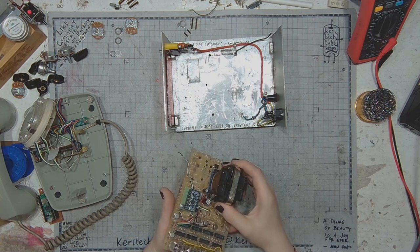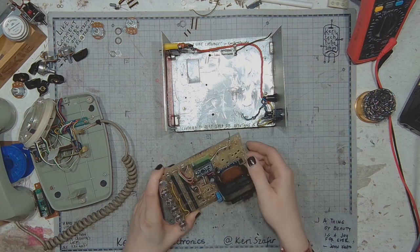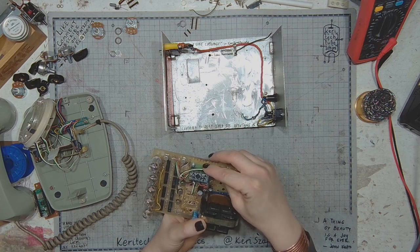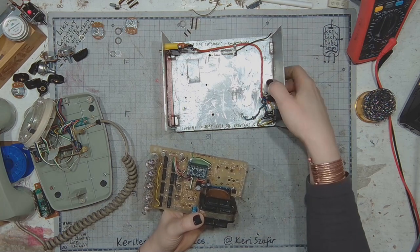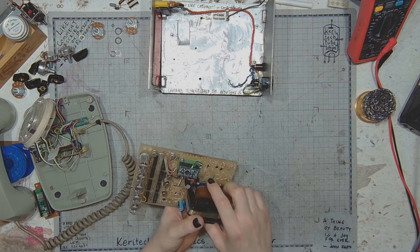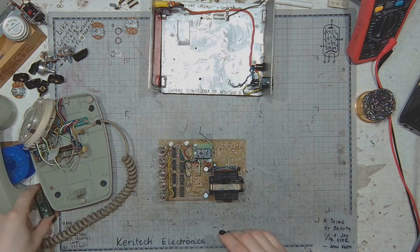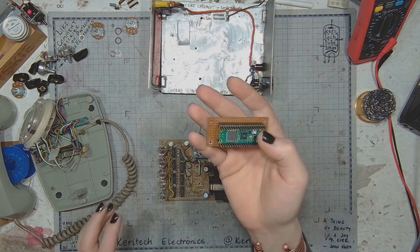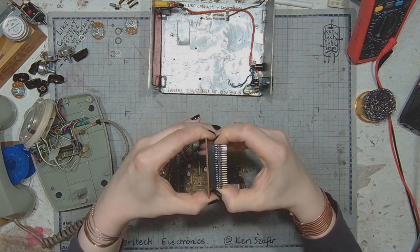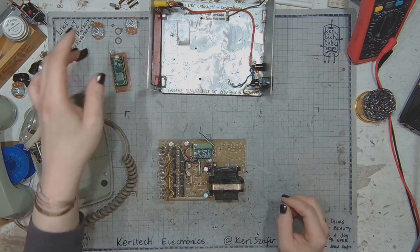But I had some problems with this project. Originally, I used an ESP8266, the NodeMCU module, but had some problems with programming it and with some hardware interrupts. Had some shenanigans. The project went to the box, got stashed, but I was thinking about it, and at some point down the road I got a Raspberry Pi Pico W that has incomparably more GPIO pins available to use.